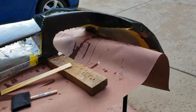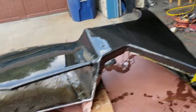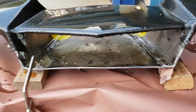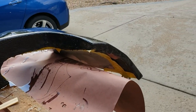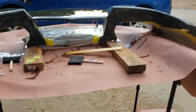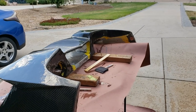Well, there you have it. We've got two layers of epoxy on this now. Don't worry about the ripples, because we're going to sand it down again and then we'll be able to clear that. The other thing we've got to do is this lower deck — we'll sand that down, body work it, and get that ready to go. Then we also have to probably put a few more coats on the front side here to get it so that it's nice and flat. But that's kind of what we went through to get a panel skinned in carbon fiber.